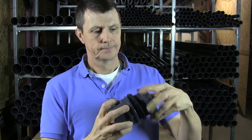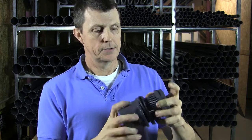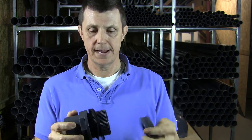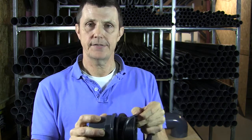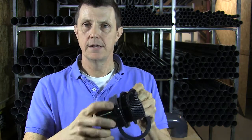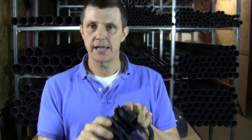Come forward a minute. We've got four parts to each tank connector. We have our back nut which goes on the back of our tank. We have two gaskets or flanges — one of which goes on the back of the tank, one of which goes on the front of the tank — and we have our front nut here which sits hard against the front of the tank. The reason I like these ones so much is because this nut here is part of the moulded tank connector.